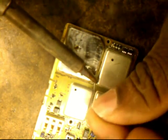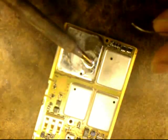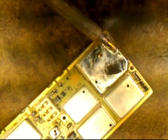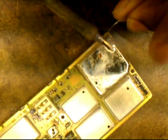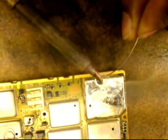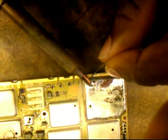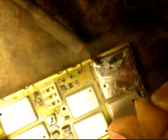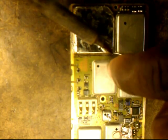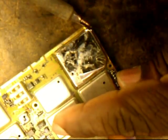I make sure the side is also soaked with solder. I add enough solder that the actual plate, when I touch it, actually melts solder. I go right around — I didn't learn this from someone else, it's the only way I can get it out. If you try to force it any other way, it's going to damage it, damage the circuit board. This is the only way I could do it — go right around and heat it up real good.